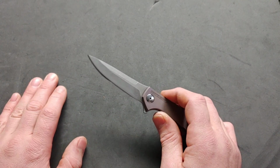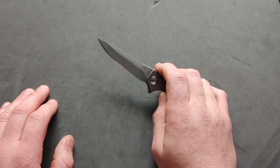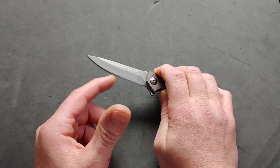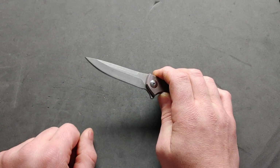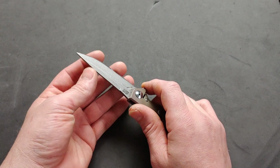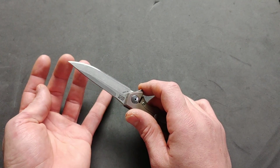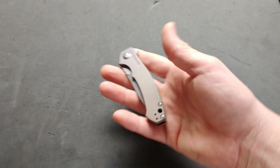It seriously basically sharpens up like chalk. I don't know if that makes any sense, but when you're sharpening it, some spots are hard and some spots are soft. Some spots sharpen, some spots don't do nothing, like just basically crumble. It makes it very difficult to sharpen. And even though I do have a sharp edge on here right now, it took so long to get this edge on here. And if I used it just a couple times, it would have spots all through it that are dull. I did hear that some of their earlier models had bad heat treats, or should I say very low HRC heat treats. I don't know. I just think it's a bad heat treat altogether.